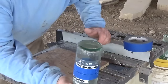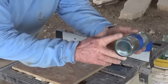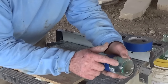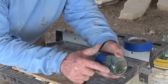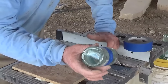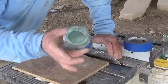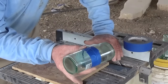I've got a six-inch bottle brick here that I can go ahead and put in place. When I mortar it, I'm going to point the mortar in between the joints down to about where I'm running my finger back and forth — that just lets more light in. This is for one of my chicken house walls, and I'm doing it so I get light in. I definitely want to get as much light as I can into the chicken house.